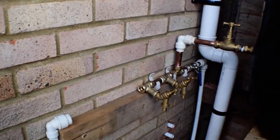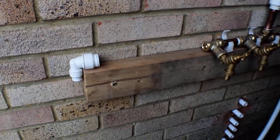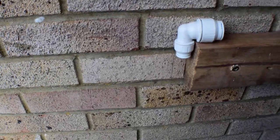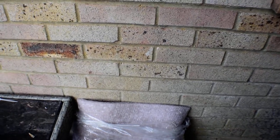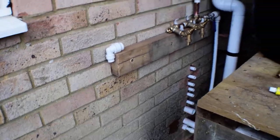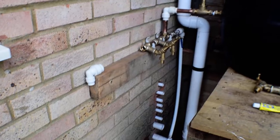I've got a little bit of wiggle room coming across, and you can see what I'm going to do is run pipe from that last outside tap to this fitting here, which is 22 on one end and 15 on the other. That will come down here, come across next to this outside tap that's already here, and that will be an outside tap for rainwater so that I can fill up watering cans from the water butt.